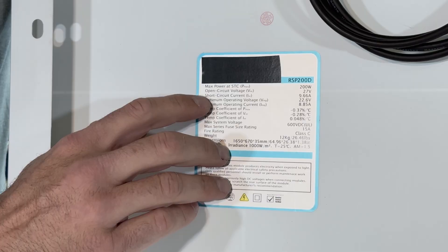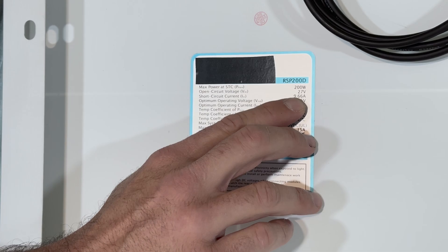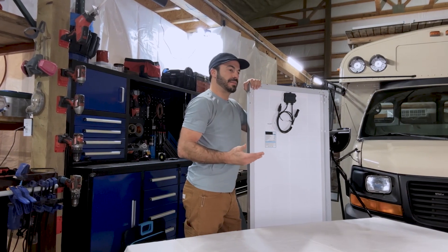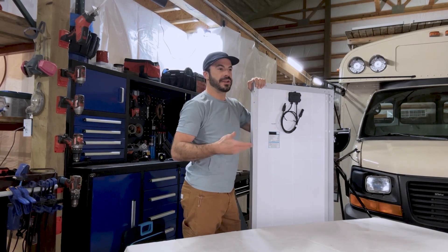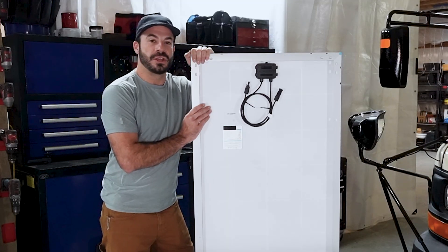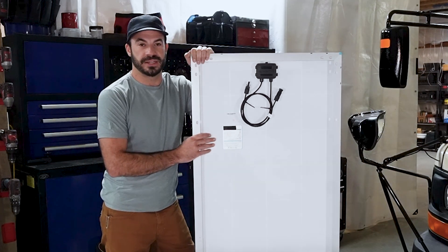The last thing you'll see here is the short circuit current. For us that is going to be 9.6 amps. 9.6 amps will work great with our products, and because 9.6 amps is something that the included wire — which is 10 gauge — can easily handle, we know we can wire it up safely without risk of overheating or damaging our conductors.